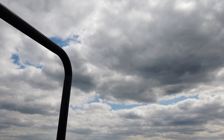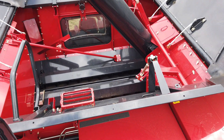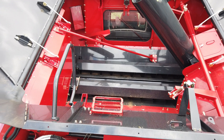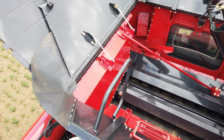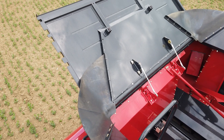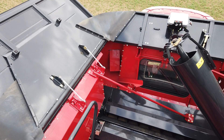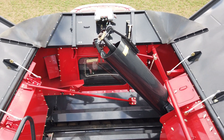From this viewpoint you can identify the bubble-up or centralising auger, the folding bracketry and mechanism, the twin unloading cross augers, the grain sample chute and the window between the tank and the cab.